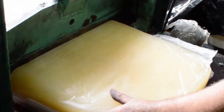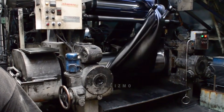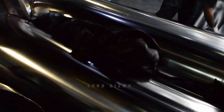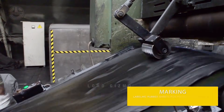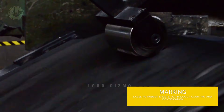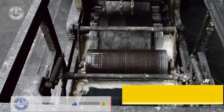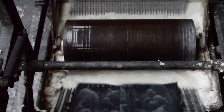This chunk of rubber is cut into two to make the whole process easier. The rubber compound is fed through heated rollers to form thin sheets of uniform thickness. It will come out as a flattened sheet of rubber. Coloring is already added to the rubber, that is why it appears black. After that, it will be placed onto a conveyor belt that leads it into a smaller roller. The purpose of this machine is to place markings on the whole rubber sheet. Then, it goes through the process of emulsion. They will be sent to another conveyor belt which leads them to the cutting area. This rubber sheet will be flattened out until it reaches a thin and smooth state.